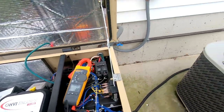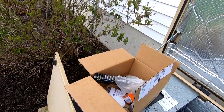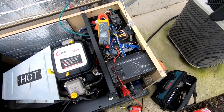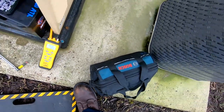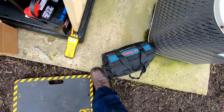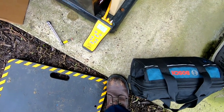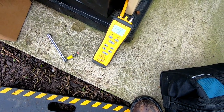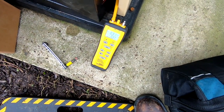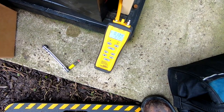It's literally a mixture of snow and rain — look at that. May 11th — I love living here in Ohio, it's just wonderful. We're on LP gas, so we're checking it as it first came on. It's at about 13.4 inches; it's supposed to be between 10 and 12. We pretty much maintained it and it dropped a touch. This is a digital gauge so it's not as quick responding.